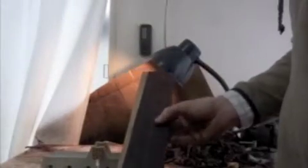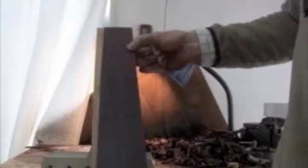So here is my prepped fretboard. It's been planed to the correct thickness. It's a little thick, but that'll come sanding down when the radius is put in. And now what I've done is I've put a center line on, which is relative to this straight edge that I prepared before, and I've marked each of the fret positions plus my top line and a cut-off point down here. I've aligned it with the grain, and I've tapped the wood, and I found the bits of it which sound the best. This part sounds a little loose grained, so I didn't want it on the board, and this part is nice, solid and clean.